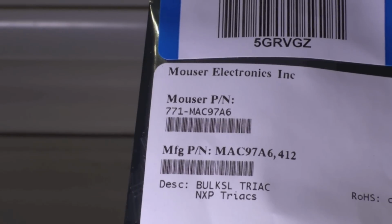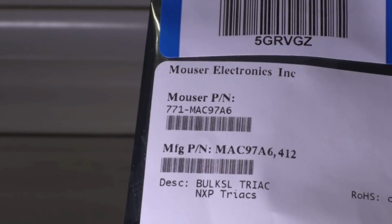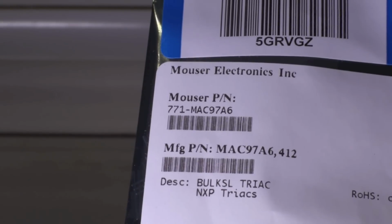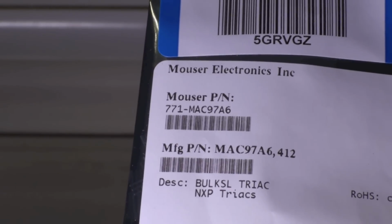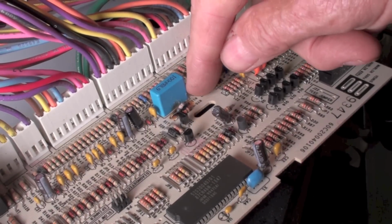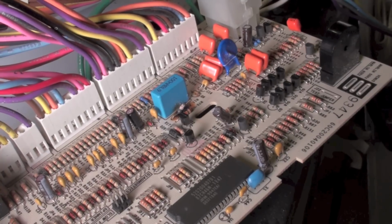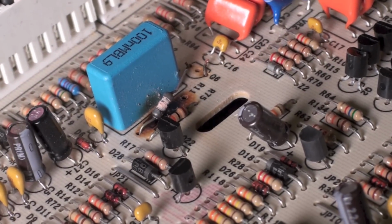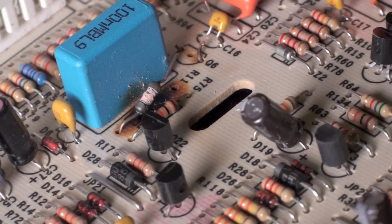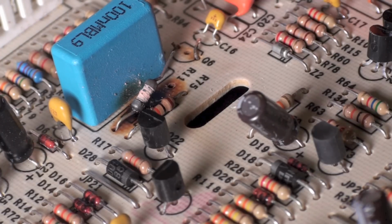Anyway, this is the Maytag Neptune. There were several model numbers. It's not a real big deal. All these Neptunes were somewhat similar as far as I can tell. Okay, you can see our bad resistor right there. And I'm going to go ahead and pull it out. I'll unsolder the back side. I've already taken the triac out.